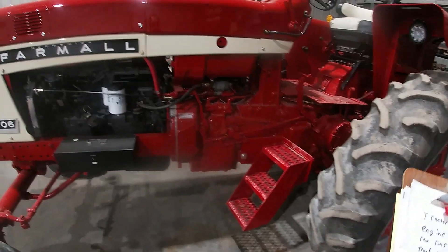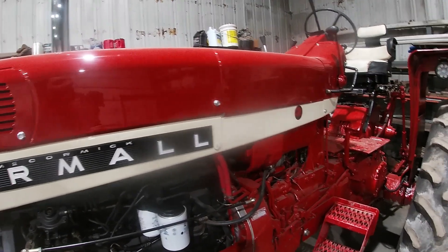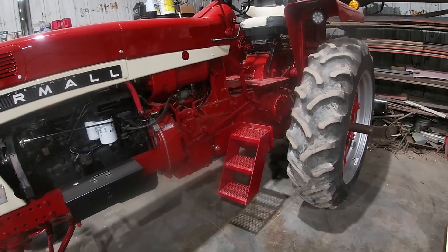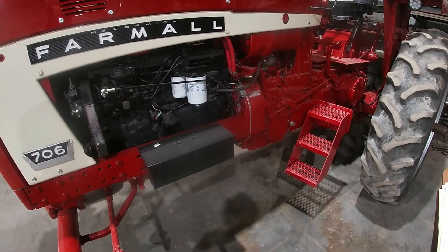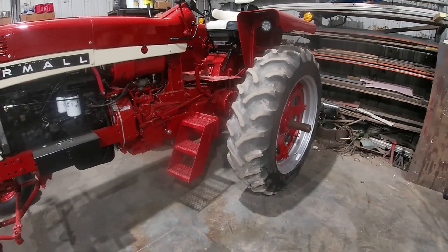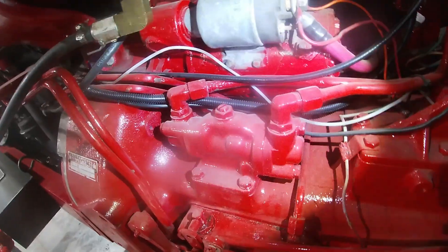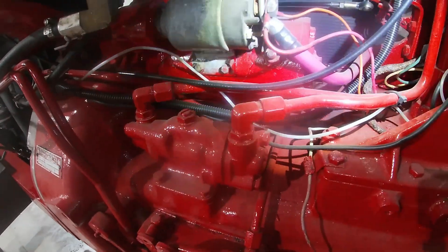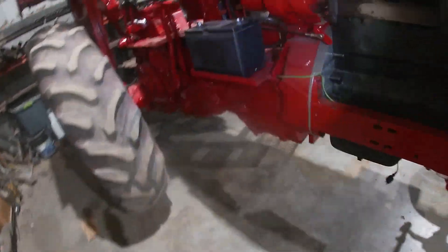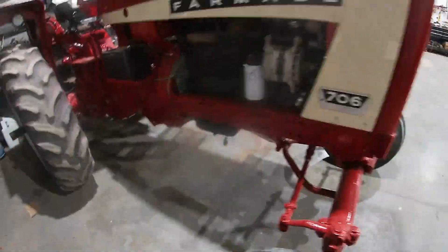Paint was 750. I had a buddy who did all the sheet metal — he does automotive work. I prepped it all, so I just took it to him and he painted it. The frame and everything else you guys saw on other videos I did myself. Had to get a starter out of a 706 diesel — gas isn't torquey enough and it's the wrong tooth count when we went to the 1066 flywheel. Just got that out of a junkyard for 150 bucks. Remanufactured was going to be darn near 500.